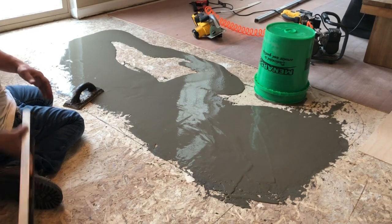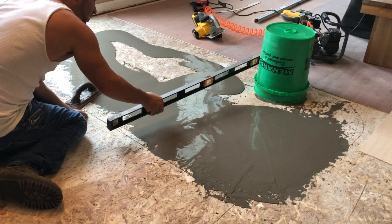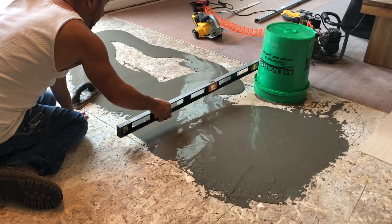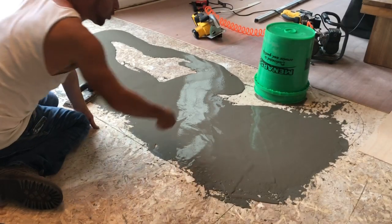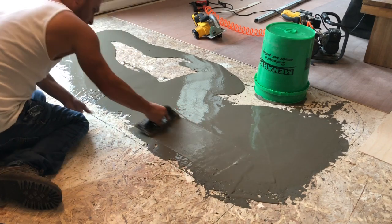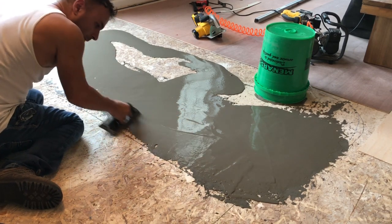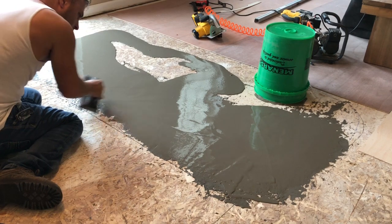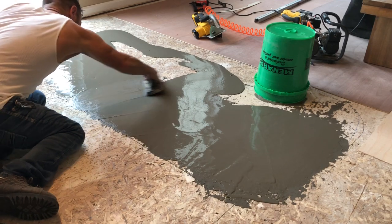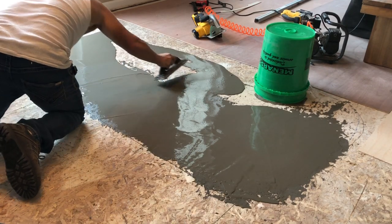When this is not completely dry but about 15 minutes in, I'll take my leveling bar and lay it on. I'm not doing it now because it's still really wet. In about 10 to 15 minutes, if I see a little hump I can still take a scraper and scrape it. If I wait a whole day I'd be in serious trouble — it does not want to scrape then. You can't just pour this down and leave it. You've got to check it with your leveling bar for any imperfections.